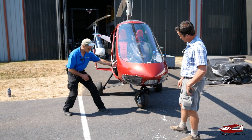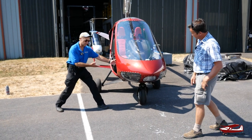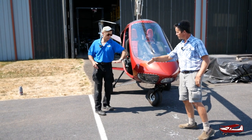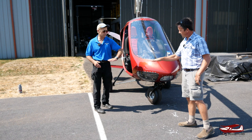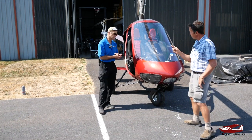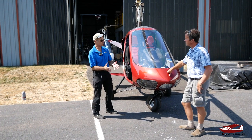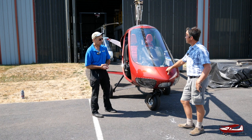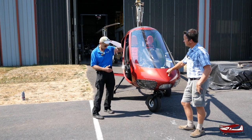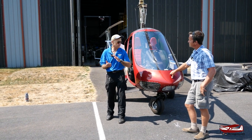One of those is the free castering nose wheel. So when you're ruddering, you can see the nose will actually turn — that happens just from the wash. It won't lock up. It could come in crooked 20 degrees or more and touch down. I've got videos of me landing crabbed and the machine just whipped straight all by itself. Normally that's when one would roll over. What's nice is when you're correcting for crosswind and your nose comes down, you never have to worry about the machine getting out of control. The rest of the world connects it directly, and when you come down a little crooked or corrected for crosswind, you can't catch it fast enough — it's impossible. So it's an extreme safety feature.